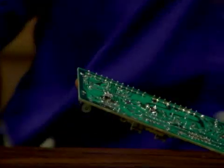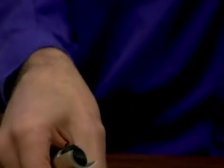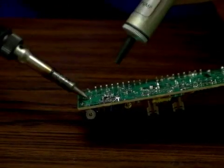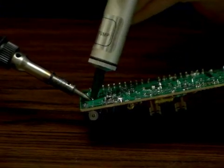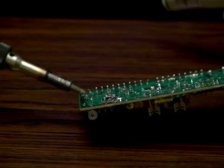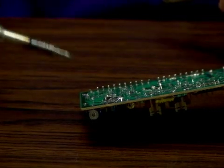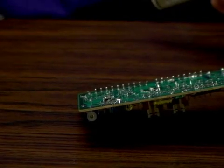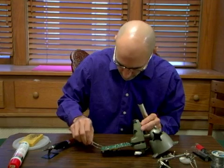I'm going to do a little adjustment here, just kind of push it down. It's almost removed. Do a little bit more just to be sure. Another thing, too, is you don't want to keep the heat on the trace — that's where the components go through a little hole. You don't want to leave it on there too long, because the trace can actually lift up if there's heat on it for too long. So it's kind of a fine line as you do stuff.